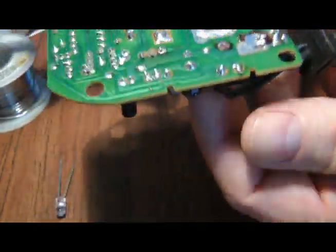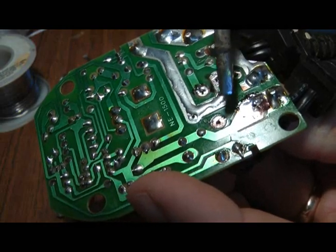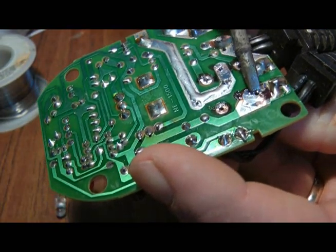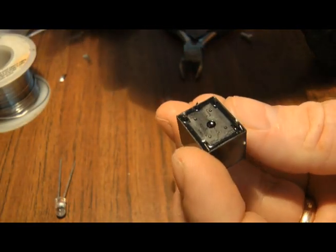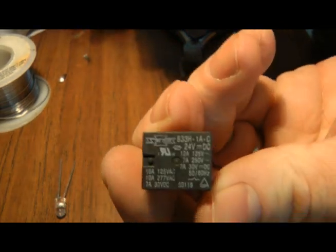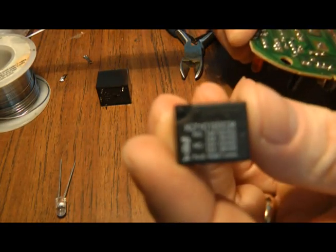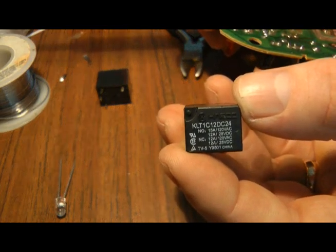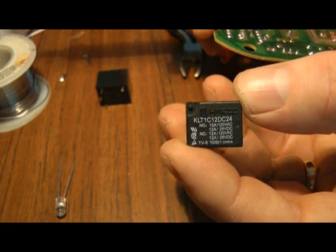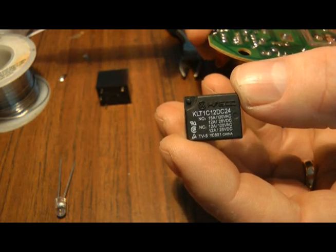What we may want to do is go ahead and once you get the relay still on there, obviously, as you reach underneath of it, grab the relay with your fingers, kind of pull down a little bit. All these up here are desoldered, so we've got the solder pulled away. Now go on to this one that's got a lot of solder on it — kind of hit it with the soldering iron, get it loosened up — and it pulls right off. So what we need to do is take this relay that I pulled off, take the new one. When you try to find a replacement relay for this, size is the problem. It's not the electronics or the rating — it's actually the physical size to fit it back into the box.